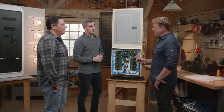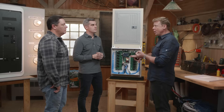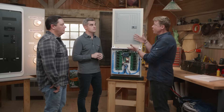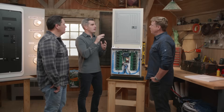So this lets us be selective. On a manual basis, you can go to your phone and turn loads on or off, but you can also do it automatically through a priority schedule. You can have the critical loads that you want to make sure always have power, then the things you'd like to have, and then the things you don't care really much about — non-critical and non-essential loads. Let's make sure I've got some basic lights on, the Wi-Fi going, the heat going, the refrigerator. I'd love for the stove to operate but I don't need it necessarily — that's in the next band. And this thing will determine whether or not there's enough power, constantly looking at the generator capacity and the battery storage. You can reconfigure that at any time because it's all via the phone.